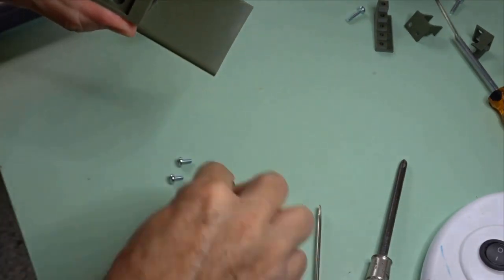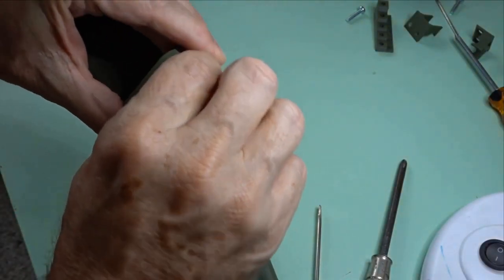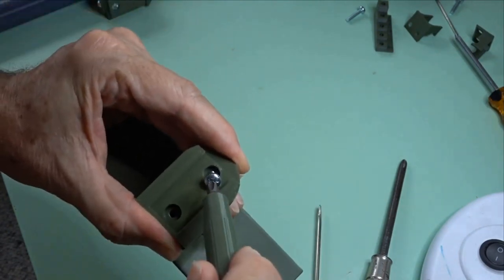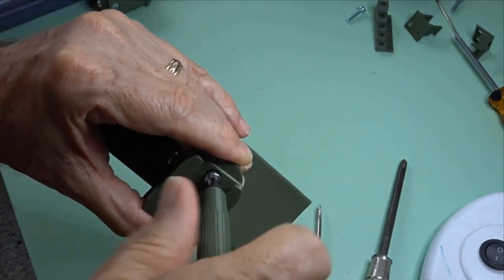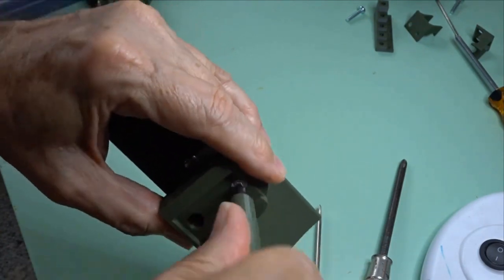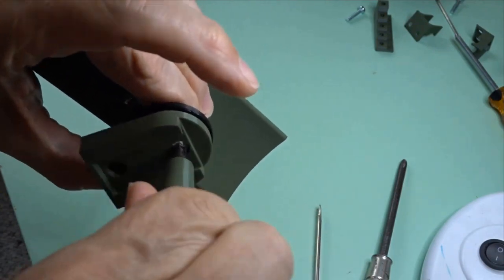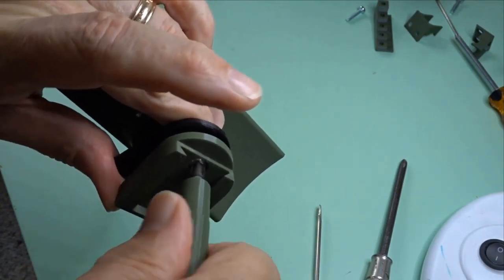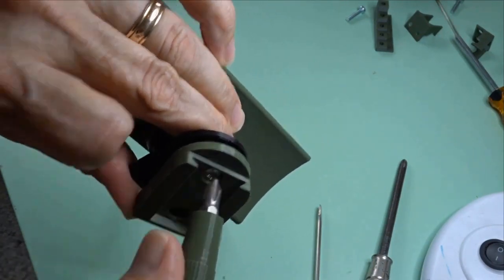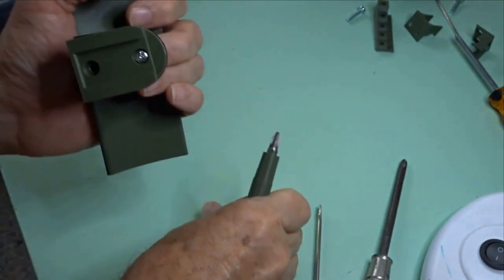And then the dovetail. It fits underneath like that. Once again, you probably want to pre-thread these just to make sure that they work. They are a bit tight. I always found a bit difficult printing with black PLA for some reason. I'd have to lower the temperature.